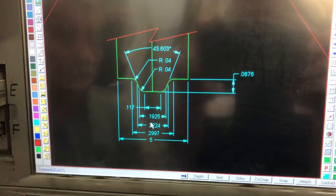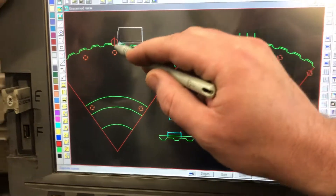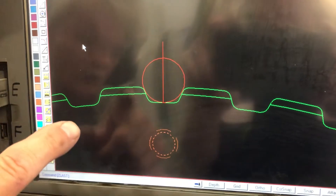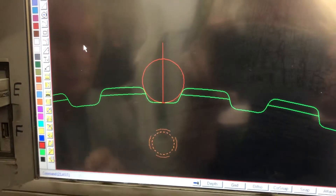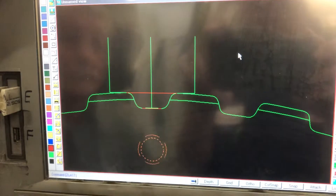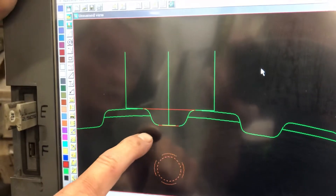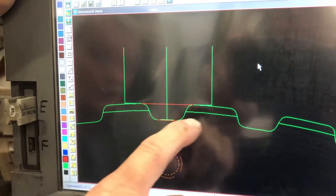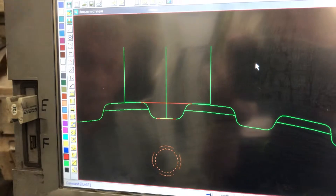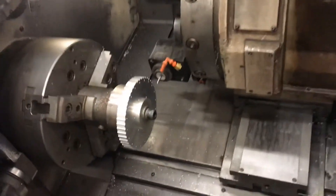So we go in with the ball end mill first. The ball end mill will go in and cut all that material out, and then our finish cutter gives us the final shape. There's the end mill on top of the outside of the part — you can see that it tangents out there nicely, so there's no sharp edge on there. Joe, if you want to fire this thing up, we've got one or two more teeth to cut.